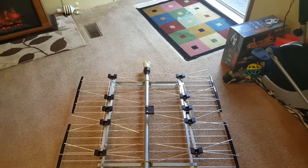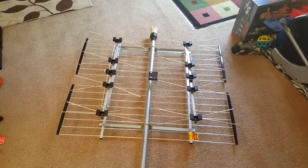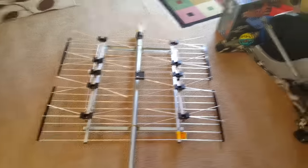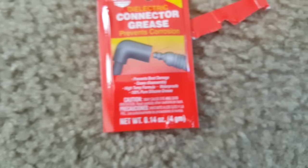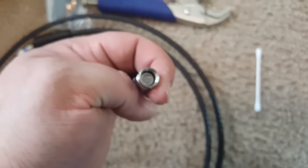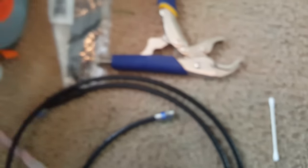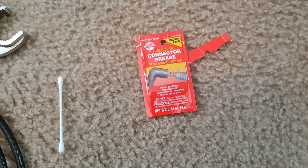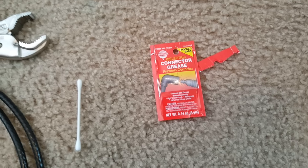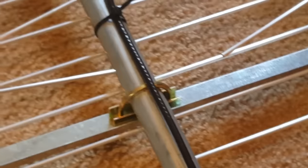Put that end in with the notch — that helps lock it. Now I've got the weather center adapter on top and the antenna assembled and on the pole. Now we're going to connect the coax cable. For weatherproofing, I'm going to put some dielectric on the inside of the connector, then some on the outside, and then wrap it in this wrap-fix to seal it even more. I see a lot of people skip this step, but I recommend it. Zip ties are done — that part is complete.